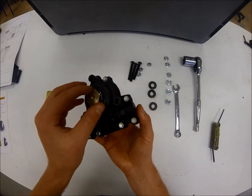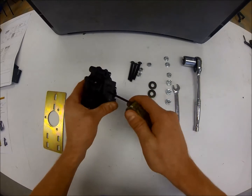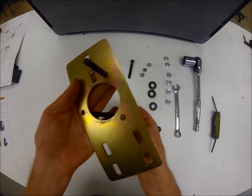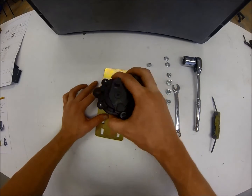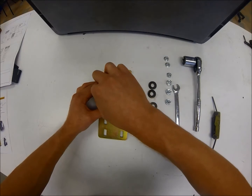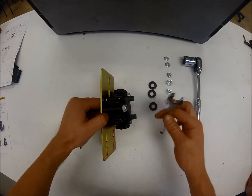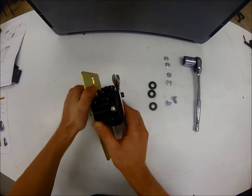As you can see in the video, custom brackets and hardware have been designed to mount the FlexSeeder system onto your planter. The hex bar end is consistent across all three models and will not change. Unique seed meter drive fixtures and brackets have been created to accommodate the different models and different seed meters required. The system shown in the video is intended to go on a John Deere 1700 series planter with a butterfly engagement seed meter driver. The video is demonstrating the mounting of the bracketry and hardware to the FlexSeeder system in preparation of mounting to the planter.